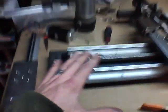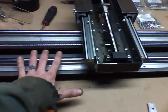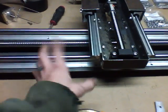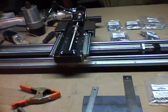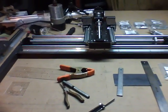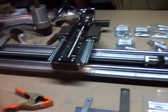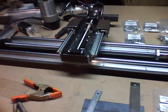Once that's done I can go ahead and mount the glides and parallel them again to the deck. If for some reason when I welded these uprights to this plate things got cattywampus, I have another shot at getting it perfectly parallel when I fix the glides to the gantry. And again, oversized holes — so in theory I should be able to fudge everything once it's done. Probably building the deck tomorrow; I don't know if I'll be done with it, but maybe tomorrow you'll see this propped up on the deck. I'd rather under-promise and over-deliver.